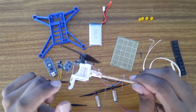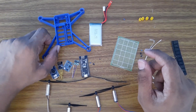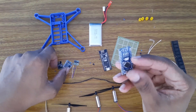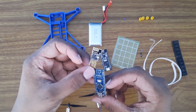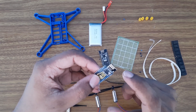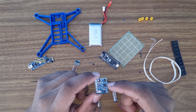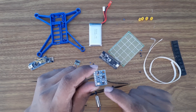Instead of using the previous design with gears, motors and propellers, I will try to make a smaller and cheaper drone. What you need is the RF Nano - the RF Nano is actually the Arduino Nano with an NRF24L01 module integrated. Alternatively, you can use the regular Arduino Nano with the SMD version of the NRF24L01 module, but this will take a lot of space and require more soldering work. You will also need the GY86 - the GY86 is a board that has three sensors.